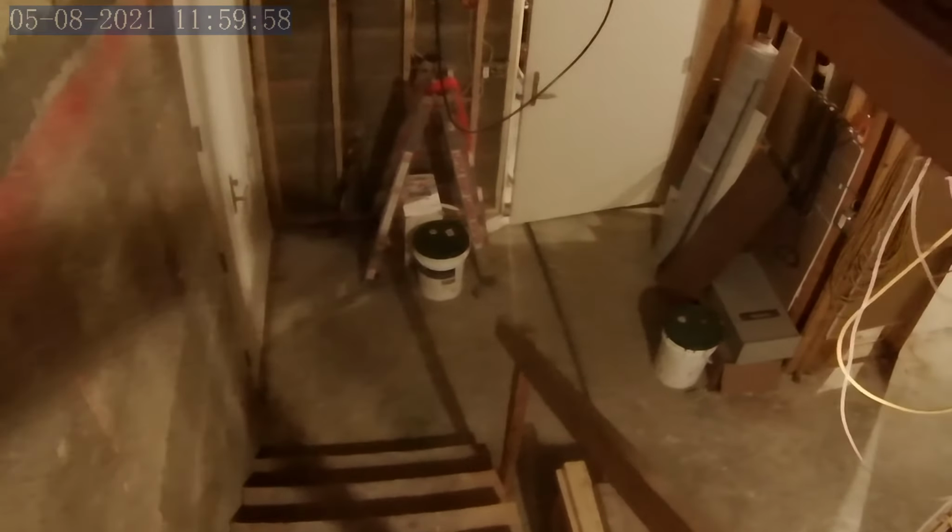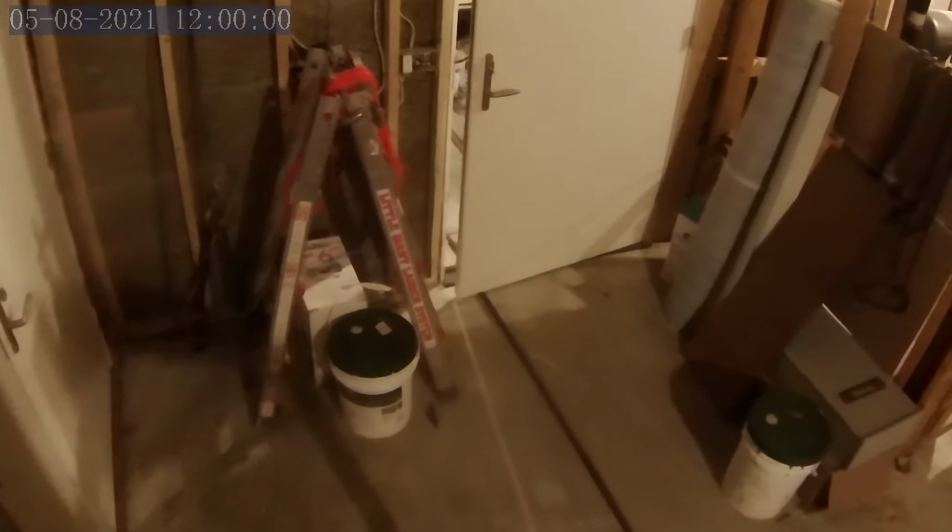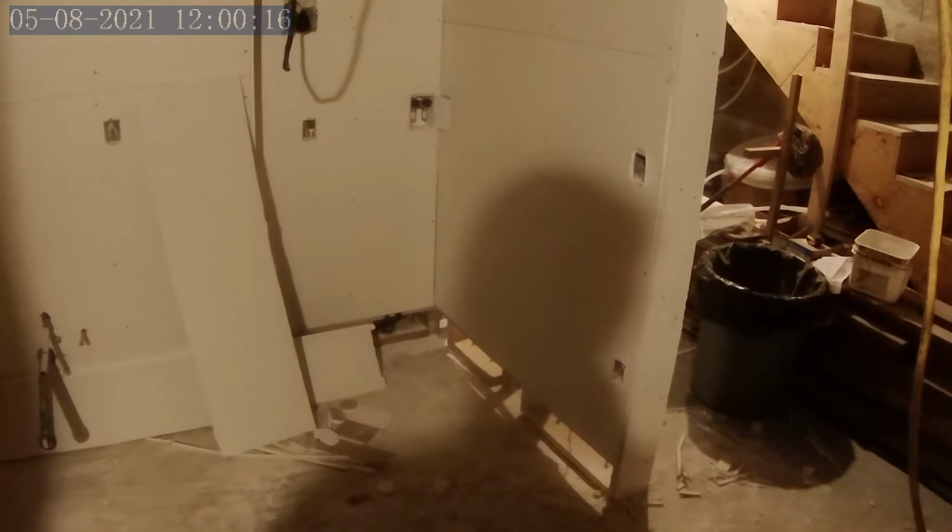All of the basement is being left undone, except for where the laundry area is. I had them quickly board that up. And so that's what this area is. The stacking laundry machines over there. We'll have a heat pump dryer, so it doesn't need any external venting. And a little bulkhead for the HRV. Got very few bulkheads in the house, and generally where they make some sense, where they provide even an architectural feature. So it was planned that way at the drawing stage.